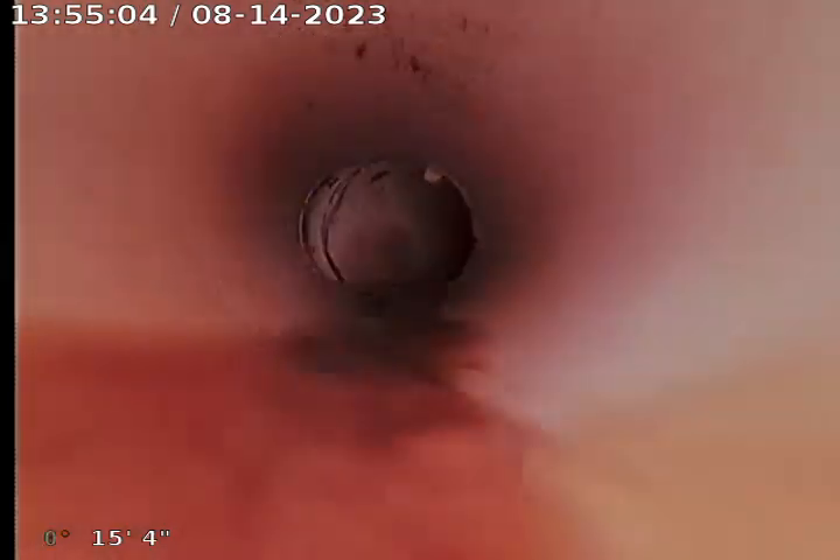Let's see if it's going to be flushed away. Loose roots there, and then we're going into the concrete section. Got more loose roots. We're going to go into the ABS portion of the line here, which seems like there's just a bit of a belly. All right, we're going to pop it out of the clean out here — and this is where the root was formed.